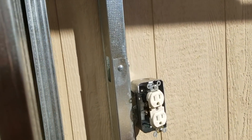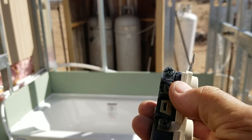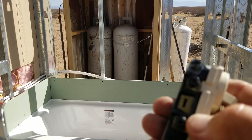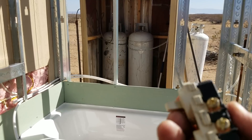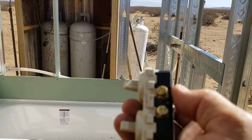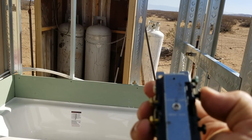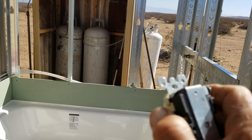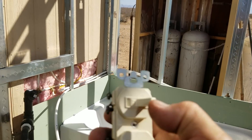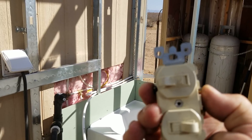Next: stack switches. You'll notice a black screw on one side of the switch unit — that's the common side, so that's where your hot wire goes. Don't get confused by the gold screws on the other side; you won't have white screws on a switch because you don't connect a neutral to a switch. All a switch does is: the black screw is the hot wire coming in, and the gold screw is the hot wire going out to whatever it's controlling — a light, a fan, or whatever. When you flip it on, it connects those two screws and lets electricity flow.